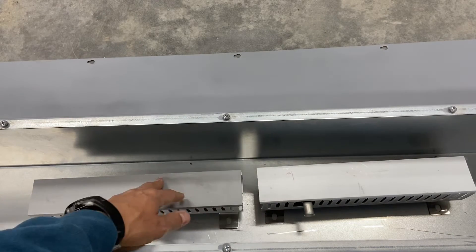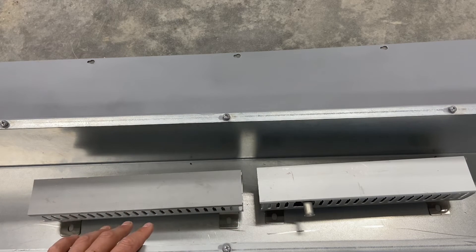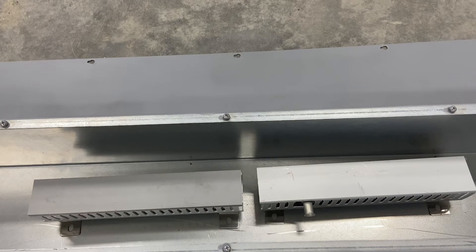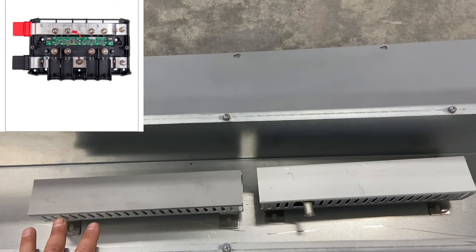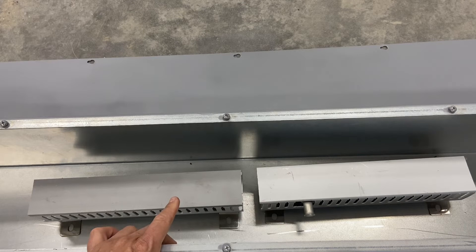My positive is going to be here and negative there, still plenty of room in the wire way — enough room for my T-class fuses and all that. If I ever wanted to go larger than these, I'd probably go with a terminal block from Overkill Solar — they have a 1000 amp bus bar — or a Lynx distributor from Victron, which is also really nice. But I think these are going to give me plenty of headroom for quite some time and plenty of room to expand.